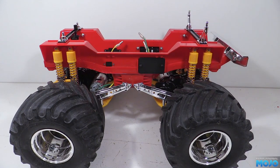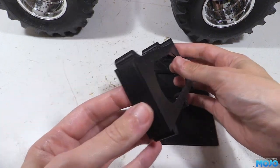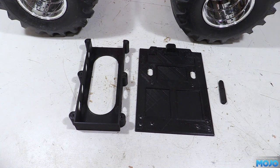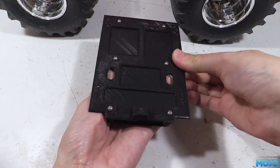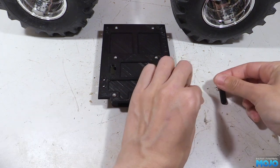Next up the electronics tray. It's in two parts so there's a nice slot to fit the 5Ah LiPo underneath. The tray has a set of recesses to fit two TBLE02s and a six-channel Flysky receiver. There's another version to fit an eight-channel that'll be handy for other types of radio too. The recesses are there so when we stick down the electronics they're going to end up perfectly square. The battery holder sits under the tray and gets attached with six M3 screws. The end of the electronics tray with the lump on it matches up with the open end of the battery holder.